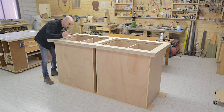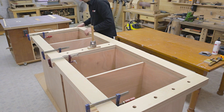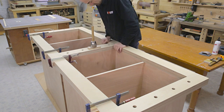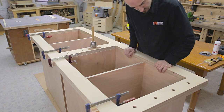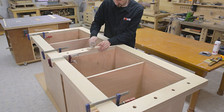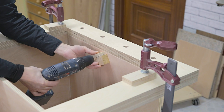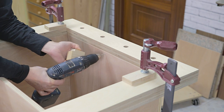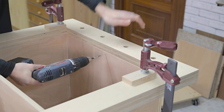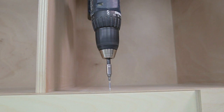Finally, I can put the frames and the cabinets together — the four parts that make up the structure of the workbench. I put the two cabinets on the floor and place the first frame on top, using clamps to make it easier to fit the cabinets into their recess. I mark the position of the screws, drill the holes and screw them on. I'm using screws in case I need to disassemble it some day; glue can be used instead.